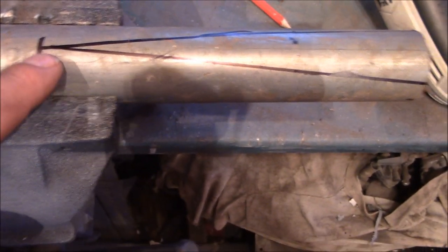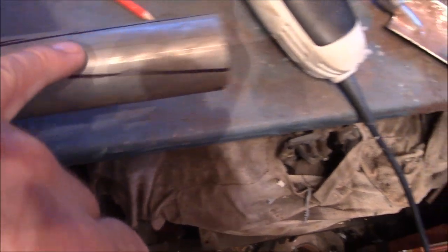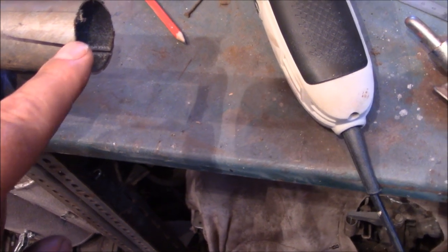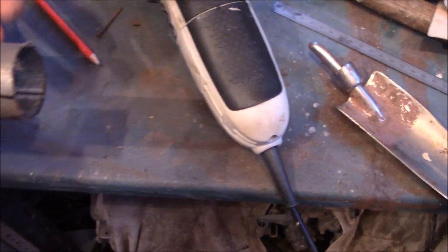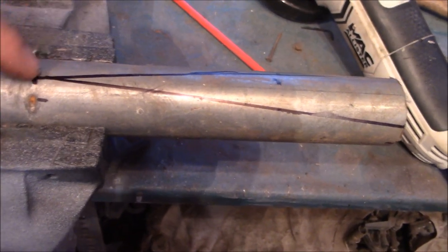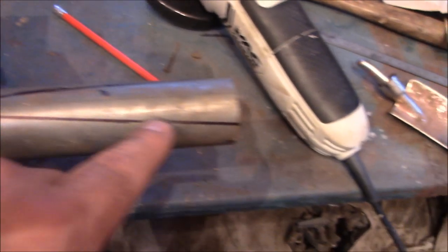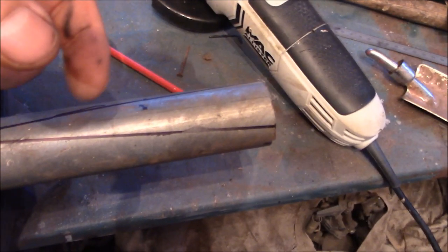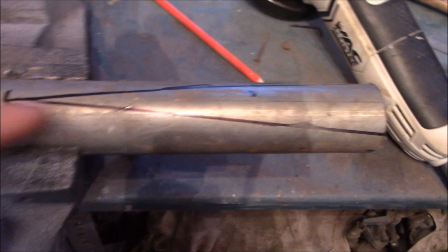The first thing is to draw a triangle. Along the natural seam on the pipe, I've found the centre point - that's where I'm going to cut from there to there, and from there to there, cutting that triangle out. I'll end up with two pieces: 25mm on one side and 25mm on the other, which means as I roll it round it'll have a circumference of 50mm - exactly the same as the end piece on the trowel. Then I'll cut along these pieces to form two pieces I can bend round into a conical shape.